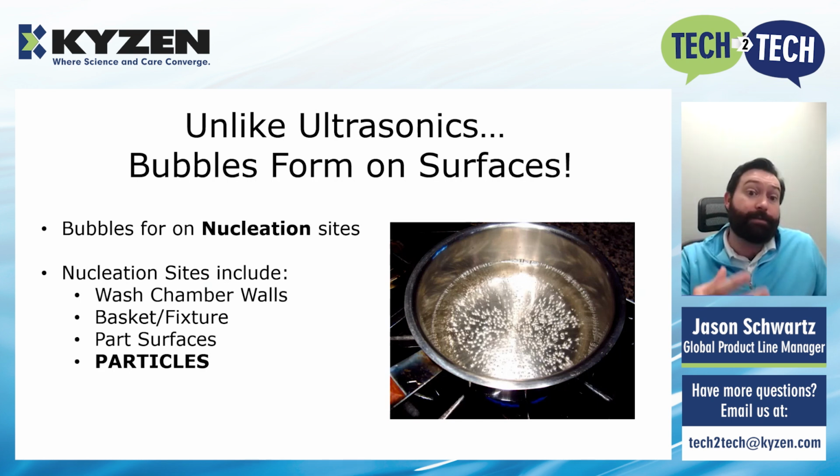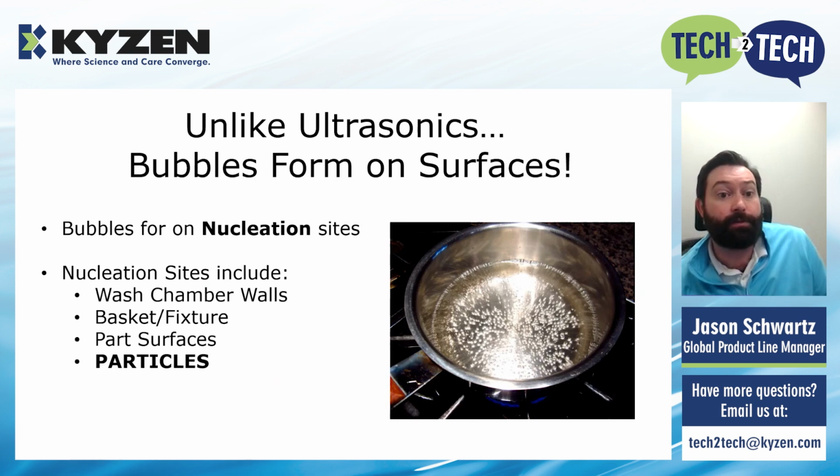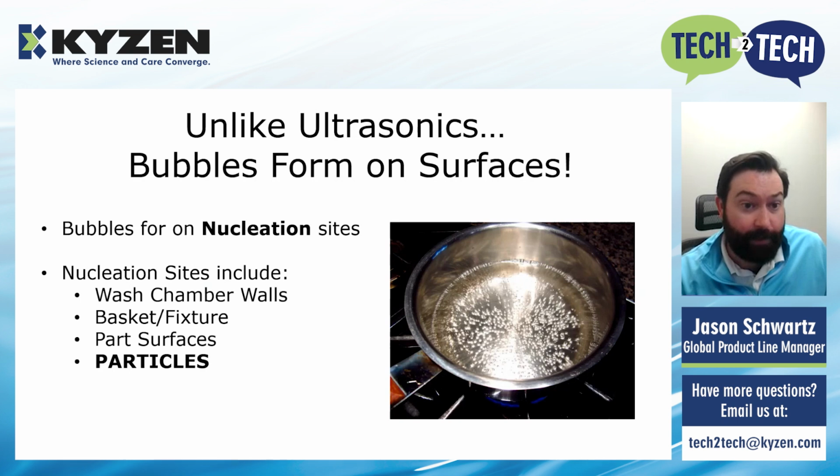Now, why is that important? Unlike ultrasonics, which shoot bubbles out and create them through sound waves and cavitation, the nucleation sites are on surfaces that include the wash chamber walls, just like your pot, and the basket or fixture that you're using. But what's really cool is that it's also directly on the part surface. If you've got a metal part that goes into this chamber, you're going to have a nucleation site on the surface. The other place you're going to have a nucleation site is on particles. That's really cool because now you've got cleaning action going on right where the thing you're trying to remove is. You don't have to direct it towards your soil or particle. It automatically forms around that particle.